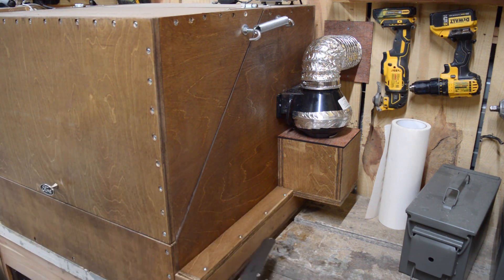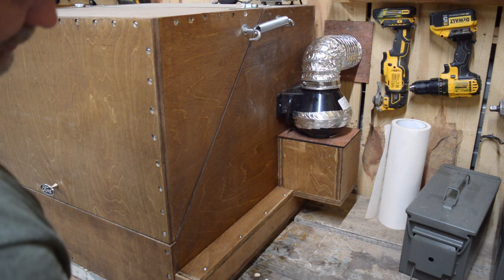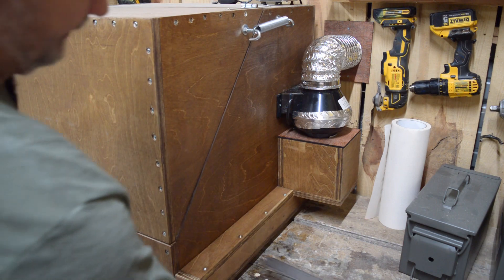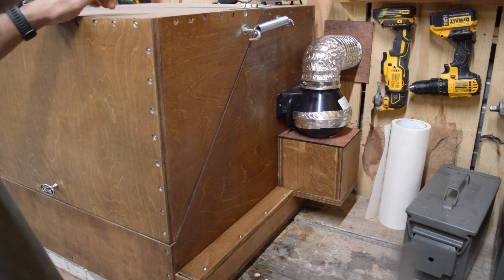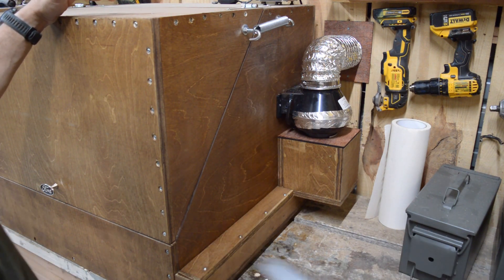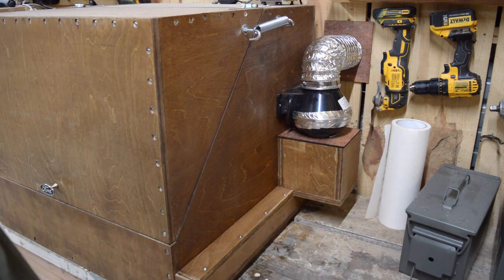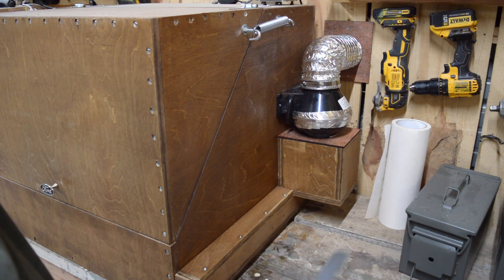Both of those are the same piece — I took that one on the band saw and cut it in half right here, then put it up there around the hose after I got it in place, and put a screw in it to hold it so the pieces are together. The fan came with mounting capabilities and I just had to make the measurements work out so it would stick down inside this box, because there's a flange that comes off it that probably sticks down another inch and a half or two inches. It pulls air in from this box, which creates negative pressure. There's a slot that's about one inch wide and four inches long on this box that connects to the other box. My negative pressure goes into here and I have half-inch holes drilled into the enclosure, all the way to the back. Those holes are raised up off the floor a little so they wouldn't be sucking in small pieces of wood and debris.